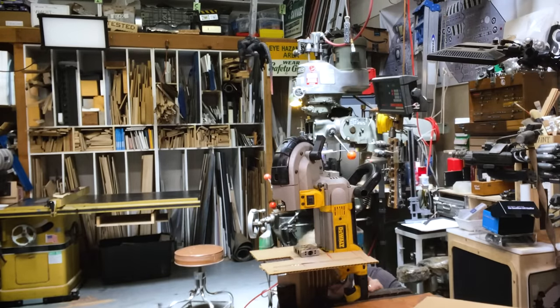And I can connect on both sides. Some switches just connect two leads or unconnect two leads. This one is always connecting something in whatever position you put it in. If I want it to be that red is on and orange is off. Yeah, red is on. So let's try these two and let's just plug it in and see if we get operation. Oh, that's operation.